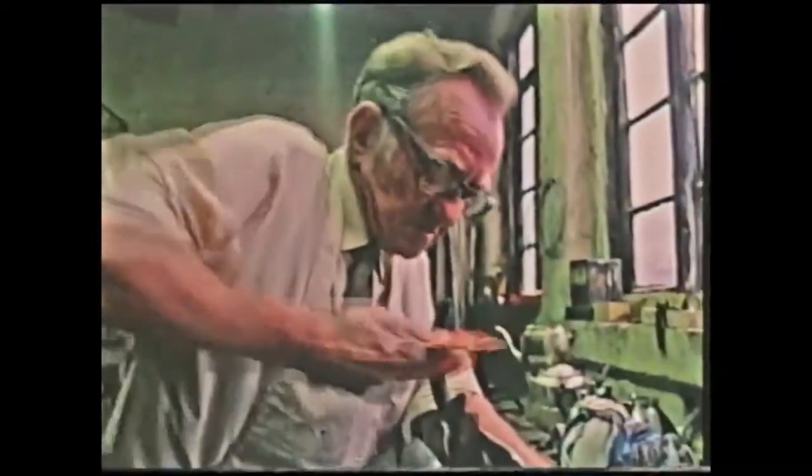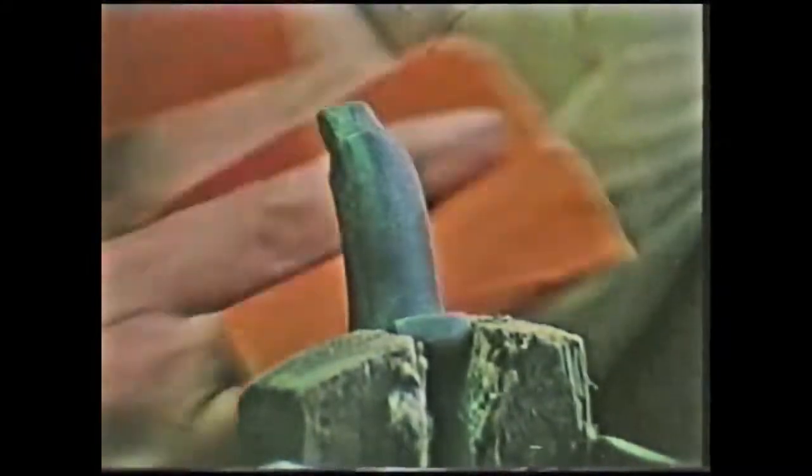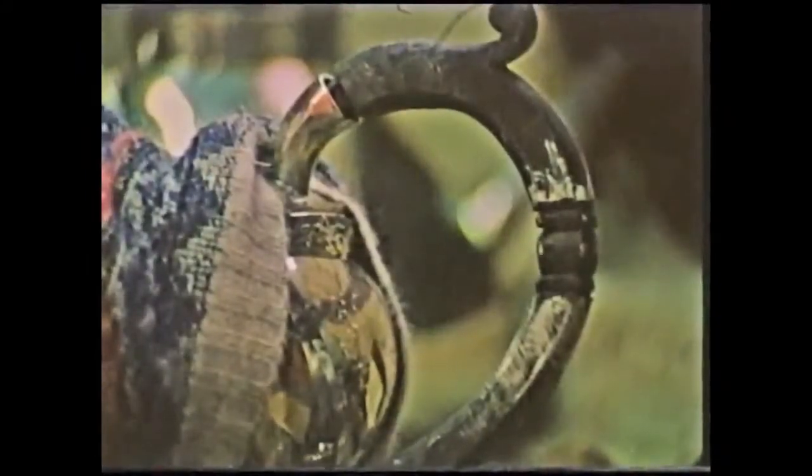For the last 50 years or more, the handles have been made from a special man-made fiber, produced from a compressed paper compound and matured for 6 months before use. Black, grey and chocolate are the standard colours used. Before this fiber compound became available, handles were made from ebony or boxwood dyed black, together with the occasional use of rosewood and ivory. The teapot in this film, incidentally, is made by J. Drury of Cambridge Street.